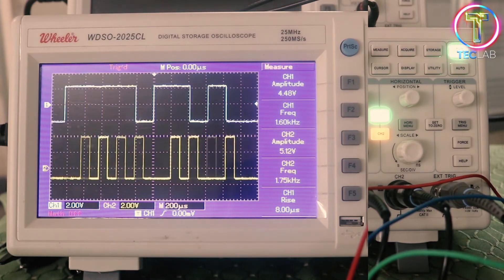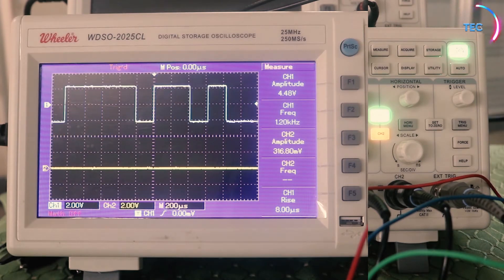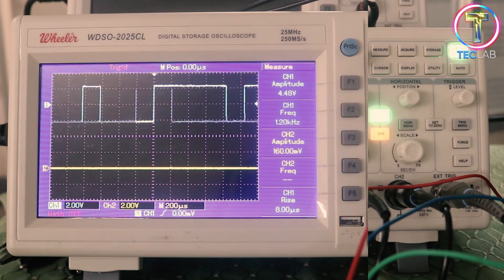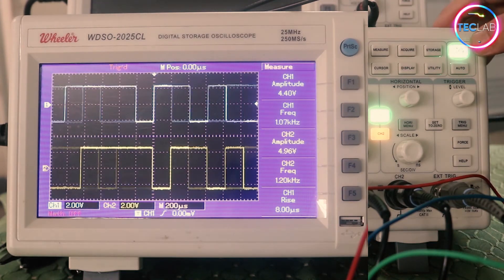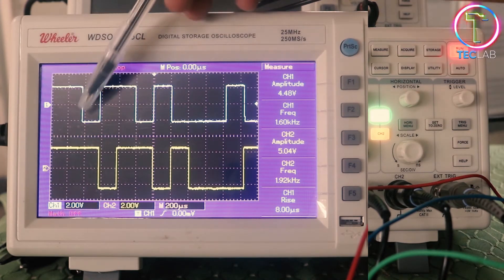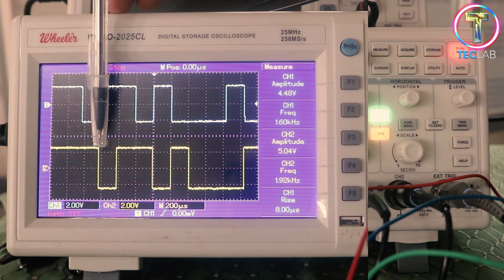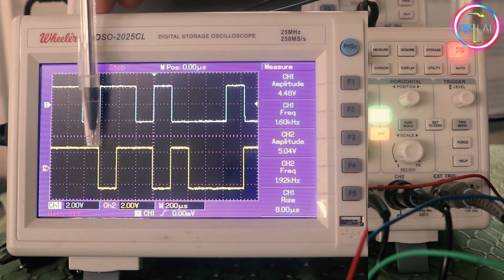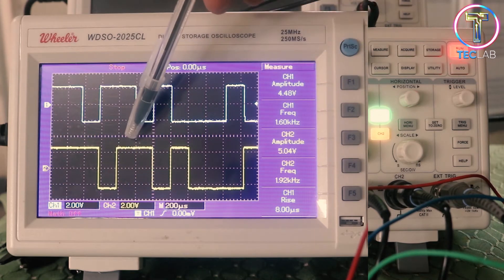We can have also another kind of decoding signal — this is the non-return-to-zero. You can change our channel to see our decoding technique signals. This is our waveform for a non-return-to-zero decoder. Pressing run/stop to appreciate the waveform: remember this is the original signal from this experiment. The output of the decoding technique will be the input of our encoding technique. If you have a bit zero the answer is bit zero, and a bit one will also be a bit one — for line decoding technique that equals non-return-to-zero.